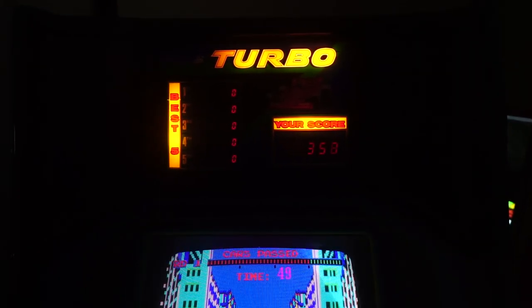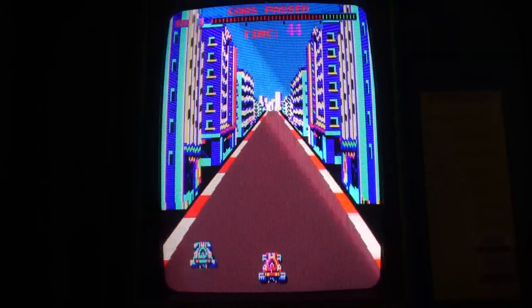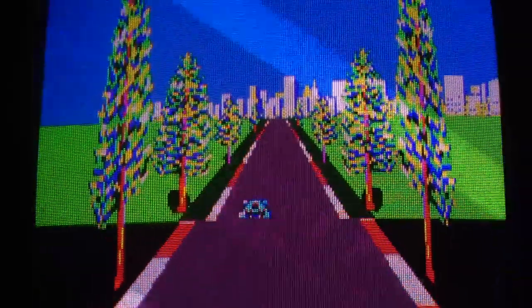13-inch monitors are not as common in the arcade world, so there are fewer choices for chassis available. I had seen a few examples of 13-inch K7000 chassis, and a few reports that 19-inch K7000 chassis would work fine on a 13-inch tube, but I wasn't quite sure about this. So instead, I decided to go for a universal chassis, having some experience with them in the past.